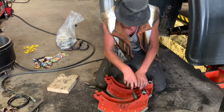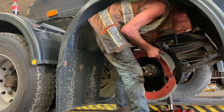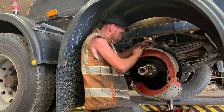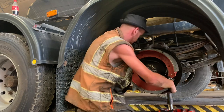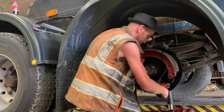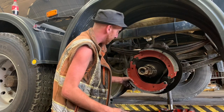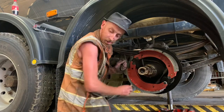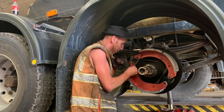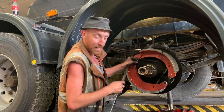Get your big return spring, clip it on that one, clip it on that one and go straight onto the next one like that. Put your top shoe in this little hanger, that one in the hanger, put that one in the cam end. Then pull this one down onto the cam, find that, and then pull that one back. Pick it up and clip it in. Then get your long Cyril screwdriver, pull it through the spring, pull it down into the shoe and hit it in. Check that it's in, same with the inner one.